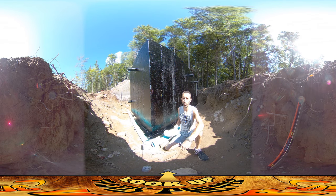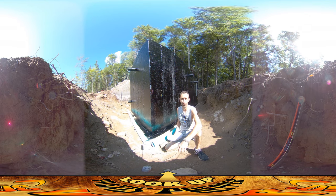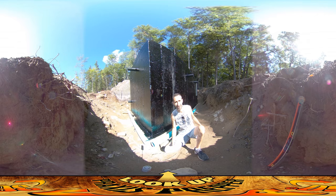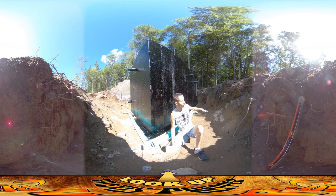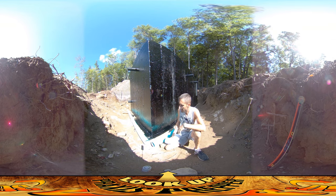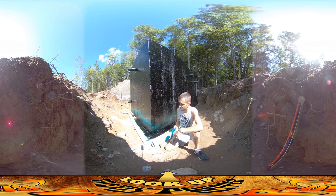So I figured I'll install the perimeter drain - it's not that much work, it's not that much money, and it's a little bit of insurance. I'm going to dig out through the dirt over there - it's not very far - to get to where the slope would meet it and the water could drain out really easily. I'm installing it with this four inch drain pipe.